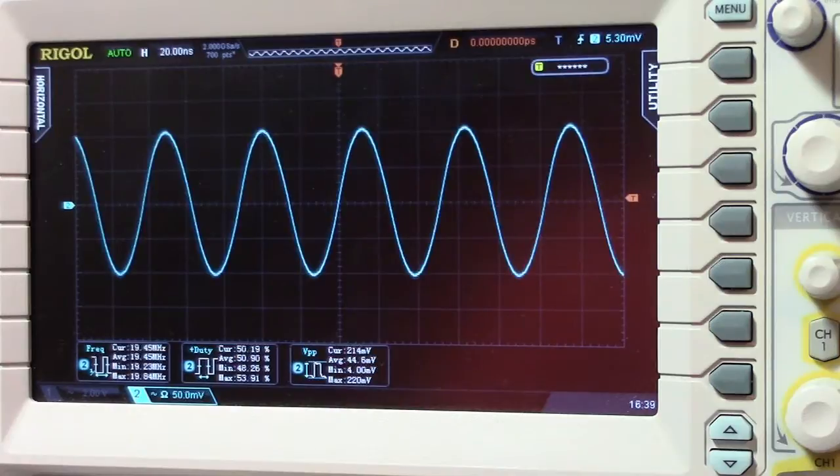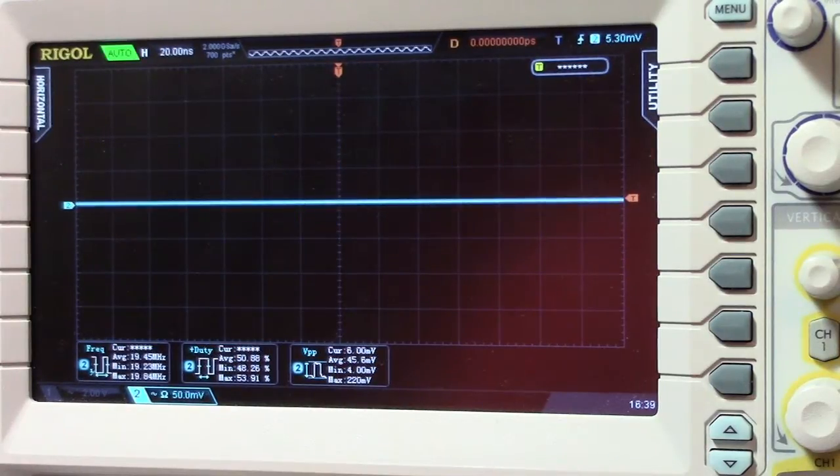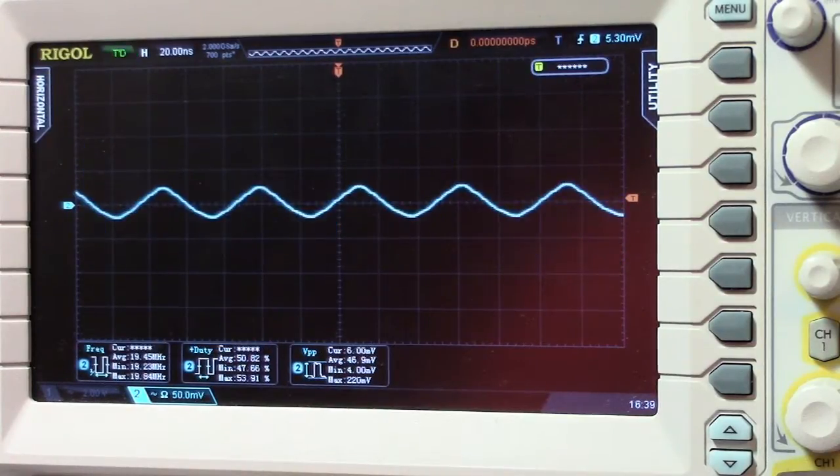And right away, oh, okay, that's not so bad. Oh, but hang on a second. This is with the attenuator in, so this is probably the 40 dB attenuator, and when it comes out, you can see there's a little bit of a lag going on there. It's not instantaneous. Oh, yeah, there's something wrong there.